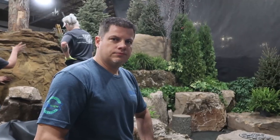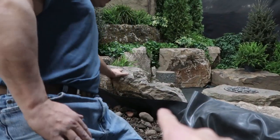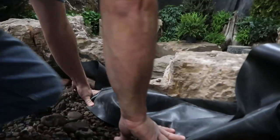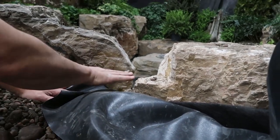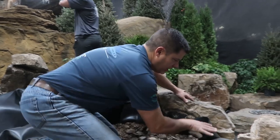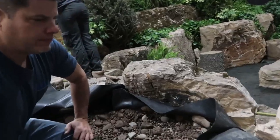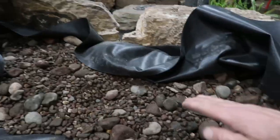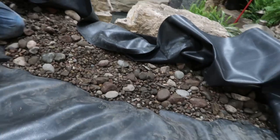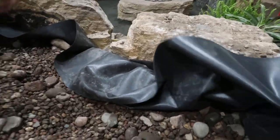Just so the viewers are clear on what's happening — this liner right here, the rock your hand is on is a frame rock, and the one to the left is also a frame rock. Show me where the water's going. So this is going to be our waterfall. We've got this below these guys. If we need to adjust this weir, we can come back in and do some other stuff — in order to raise the water level in the pond based on the thickness of that water coming over the weir stone. This liner, the pond liner, comes up over our little weir that we've created here, then comes down — this is where the overlap happens. Our basin liner comes up underneath the pond liner and up and down over this weir, so the pond liner does the opposite: goes up, down, and back up — that's the liner we see here.